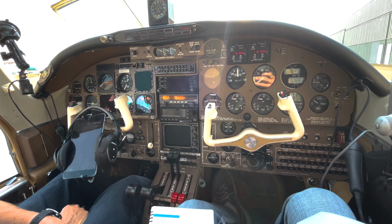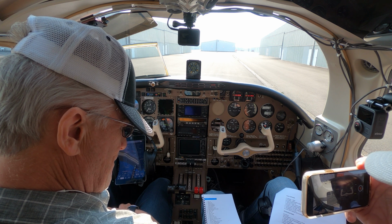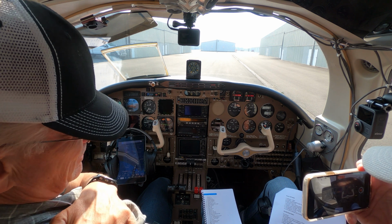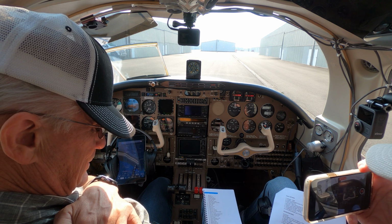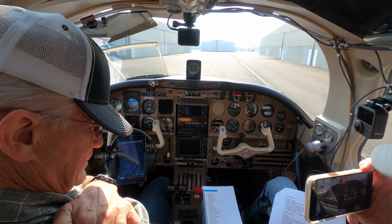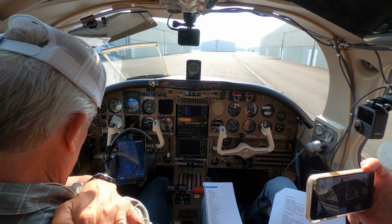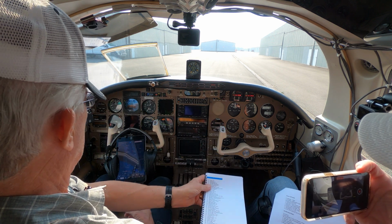Well, your door seals, your dump valve. Let's see. You did all that. Yeah, you did. Auxiliary master. Manifold pressure. You haven't done that yet. Well, it's kind of automatic to look at it. Yeah. But totalizer. That just verifies. There was your totalizer there. Yep. Auxiliary fuel pump, auxiliary fuel lights, auxiliary fuel quantity, annunciator panel, door seal, autopilot master off, fuel quantity check, which you just did, avionics master off, and then of course your alert lights, TC running. I guess you pretty much got it all. Yeah. All right, so go to the next one.